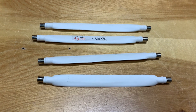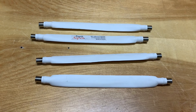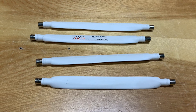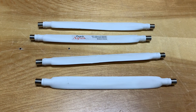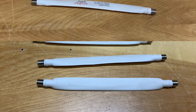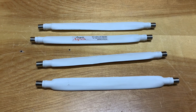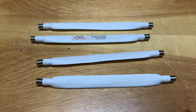These flat style cables are also probably best used if you're dealing with strong over-the-air signals. If you have a few weaker signals in your area — for example, TV stations you're only able to pull in around 40% — that three, five, or ten percent signal loss might make the difference between receiving a channel and not. So these are handy and convenient but really work best with strong signals. If you're going to install one of these and you have some weak TV signals in your area, just be aware that it might mean sacrificing a couple of channels. But if you live in a rental property or just don't have the ability to safely drill a hole in the side of your house, then this might be the solution for you.